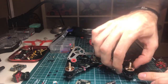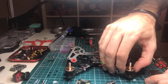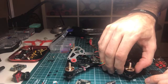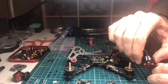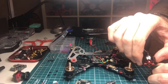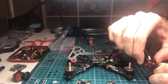And the notches are smaller, right? Like, when I turn this, each little notch is tiny. Tiny, tiny little notch, which is the bell, the magnets on the bell and the stator interacting. Whereas on this guy, the notches are much bigger. They're not that much bigger on this one, but they're way more defined. It really slams into place on each one of these notches.